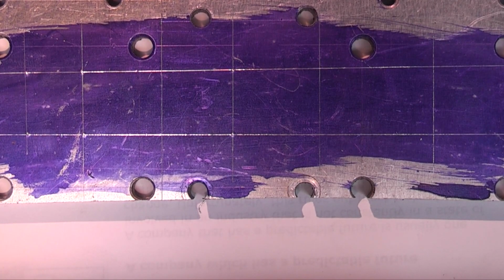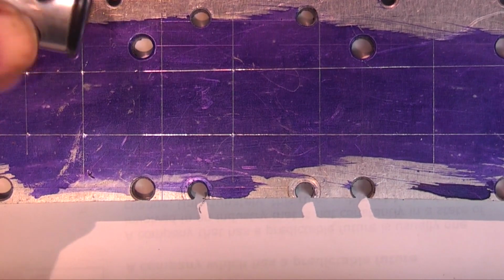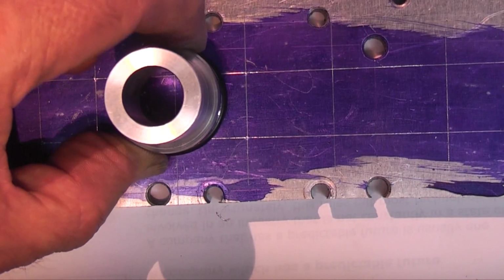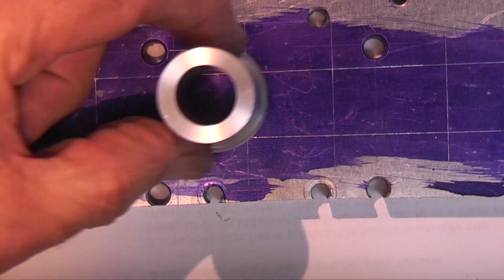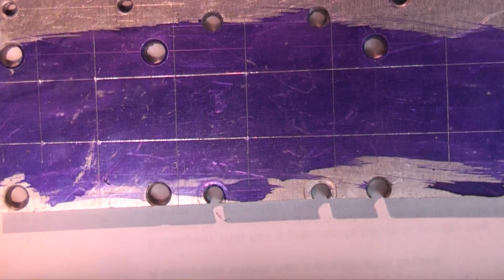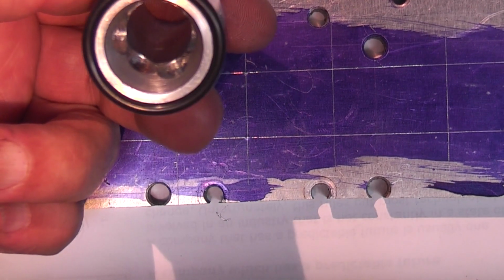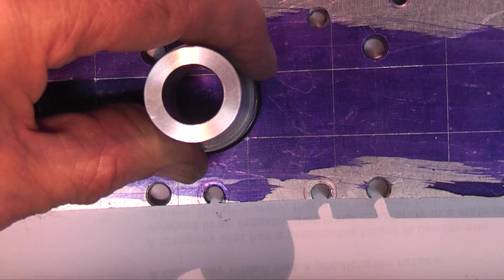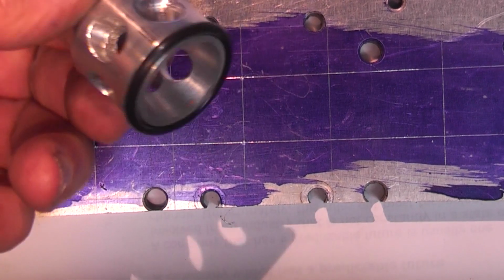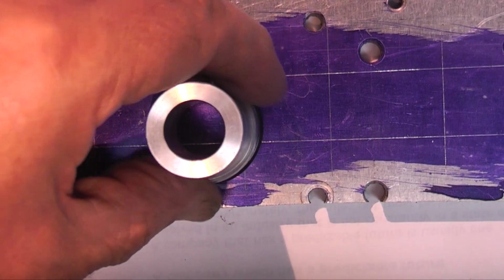If you want to make one of these centre finders, start with a 15mm Perspex rod. It is worth putting an O-ring on because even on this, look, you can see when I move it, it moves a whole lot. Whereas if I didn't put an O-ring on, take it off, you can move it anywhere and it's not gripping. So you might move it just as you're swapping the lens over. The O-ring on the end I definitely put on. If you machine it too small and it doesn't grip, just put some super glue on and push it down. It's only the friction you're trying to get, it doesn't do anything other than that. It needs to be just proud of the surface of the finder so that it touches the O-ring.